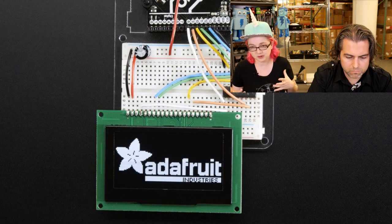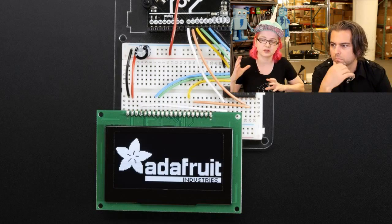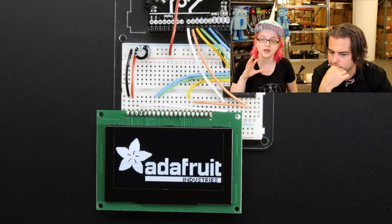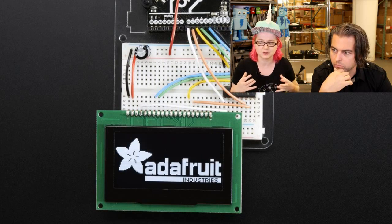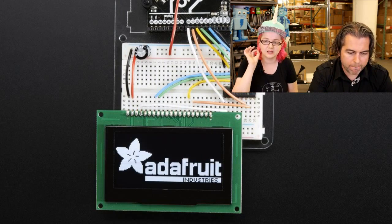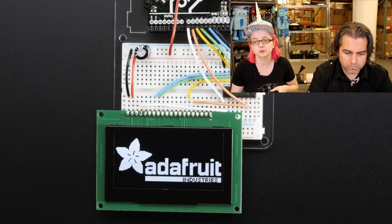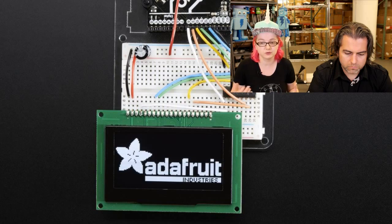It's just a gigantic OLED. What we really like about OLEDs is that they're very high contrast. Whether indoors or outdoors with changing light, they're really vivid. Unlike LCDs or TFTs, there's no backlight leaking light everywhere. With OLEDs, every single pixel is its own light. When the pixel is off, it's truly black — no light leaking at all. So you can pretty much read them outdoors. They just look really, really good.